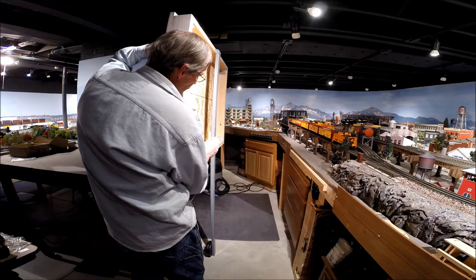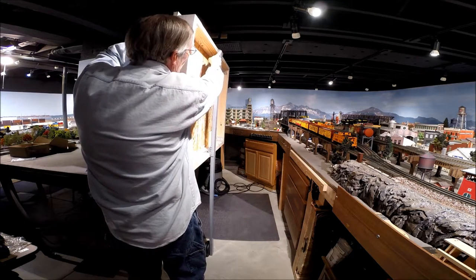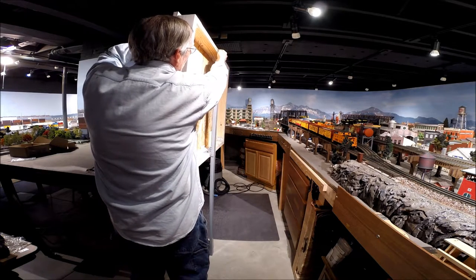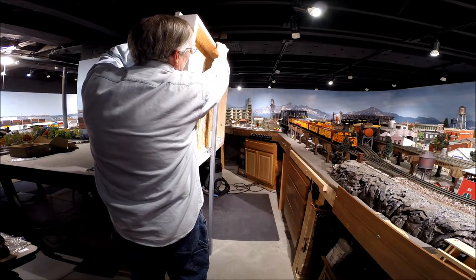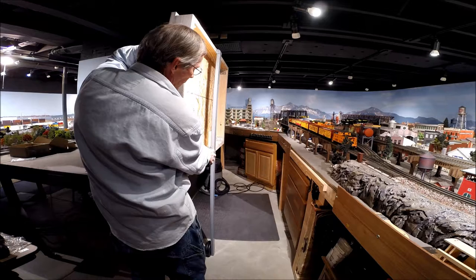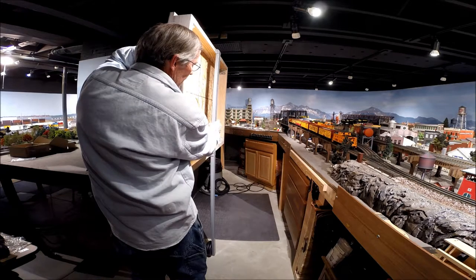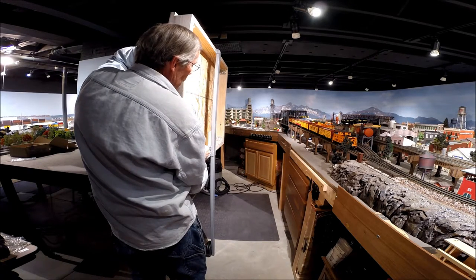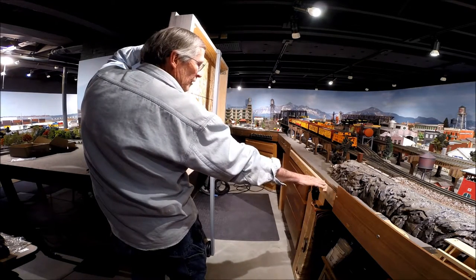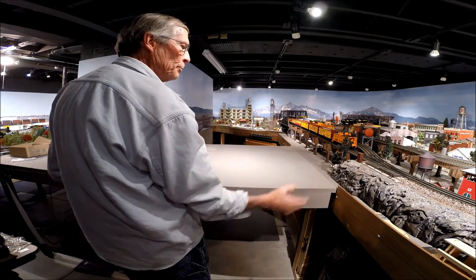I just want to make sure that once it's in place, it's sturdy, it's strong, it's not going to come apart. Now, at this point over here, my original thought was to hard mount with carriage bolts into this section of the 2x4, and I actually did that, but when I was welding this thing together, there was a little bit of twist in this beam, and when I bolted it down, it started lifting this side up, and when it came down, it wasn't sitting flush. Whereas you can see right here, it'll come down and it's pretty much flush.